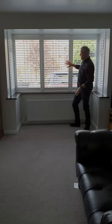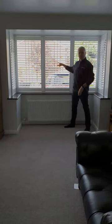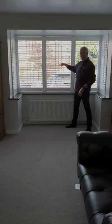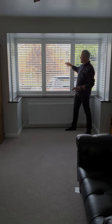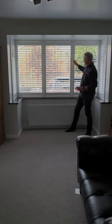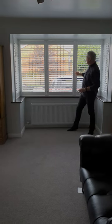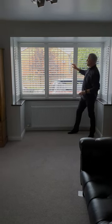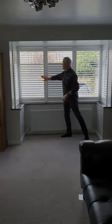There are no visible tilt rods on these shutters, because that would get busy with the leaded windows. So we've gone for a hidden tilt rod, which is actually hidden in this stile here — there's nothing at the front or back, you don't see the tilt rod at all. It's hidden in the stile, and that enables us to split the shutter at around the midpoint.